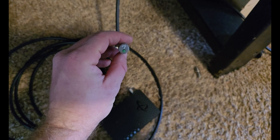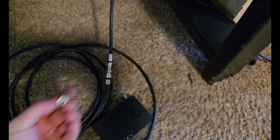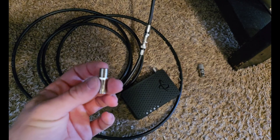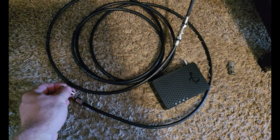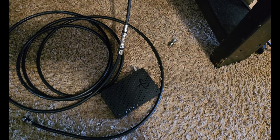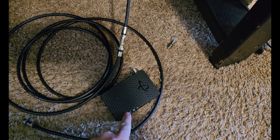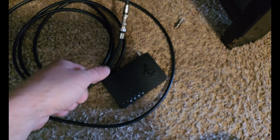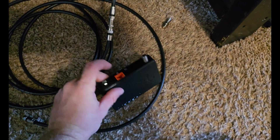I'm using these coax identifiers — you put a number tag on it and plug it onto the end of the coax. Since I don't have a face plate here, I'm just using this barrel to put it on. Now you might just get lucky and plug these up and they'll automatically connect. There are two lights: green and blue. Green means connected but not fast. Blue means the full 2.5 gigabit per second.